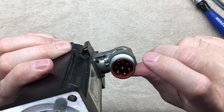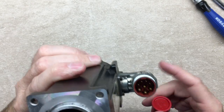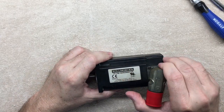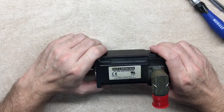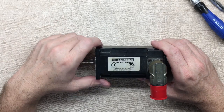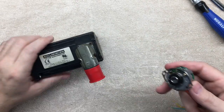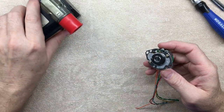At the connector you've got your three phases and ground, and then also connections for a brake, and also for the smart encoder feedback. This is a smart feedback device — not just the older type. The older units have resolvers, meaning they actually used a sine wave, different phase sine waves, for positioning. Encoders of course use digital pulses.